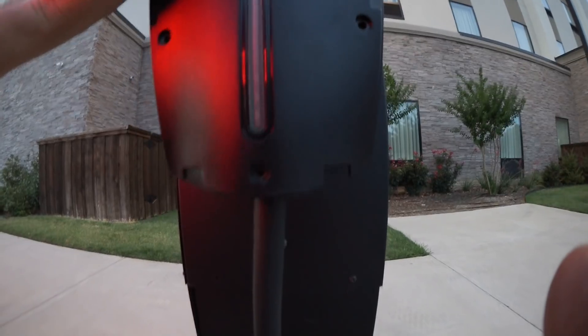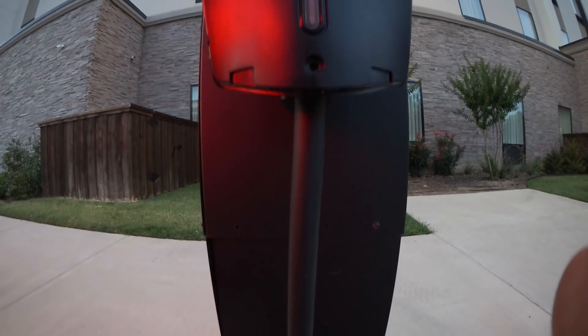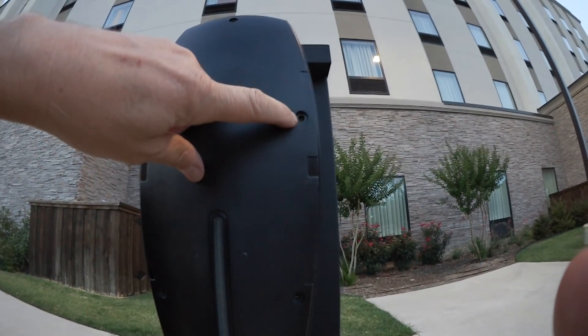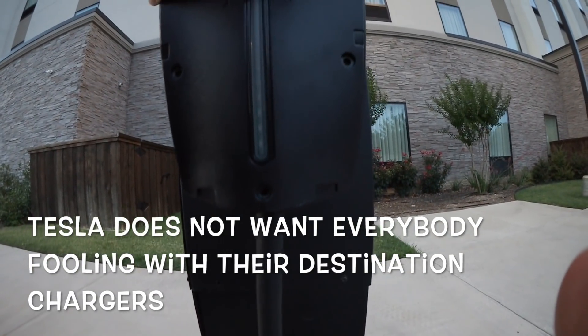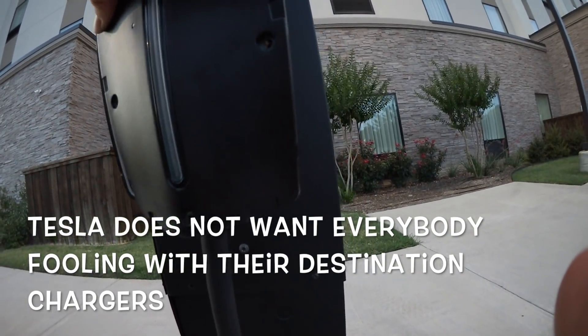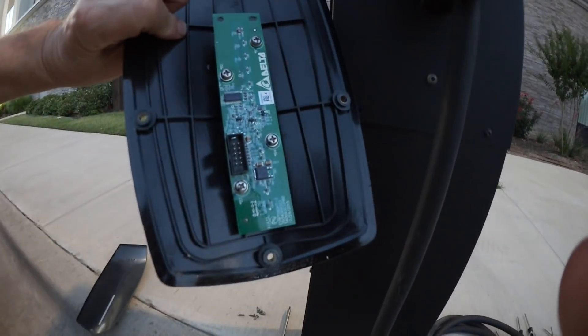After you get that lid down, there is another one — it's on the other side. This is the lid for that. That lid has six Torx 20 screws. The Torx 20 screws have a hole in them — it's a Torx 20 with a hole, and I actually have that tool. Remove them, then be careful also removing the contacts for the lighting. Then you can go inside.